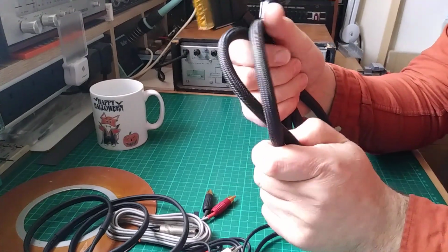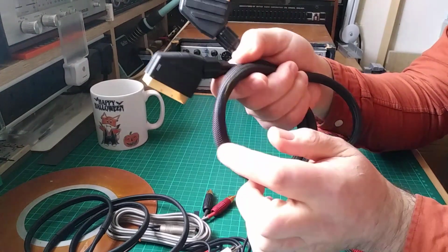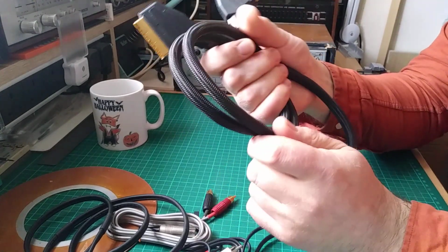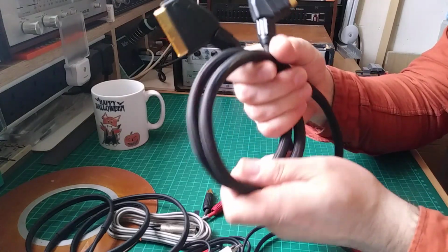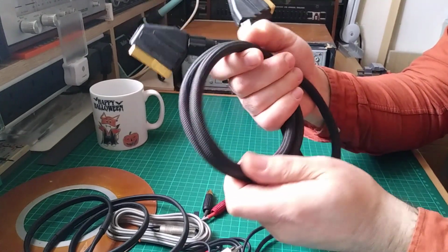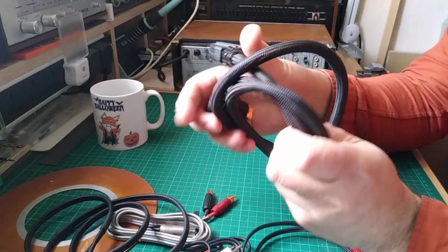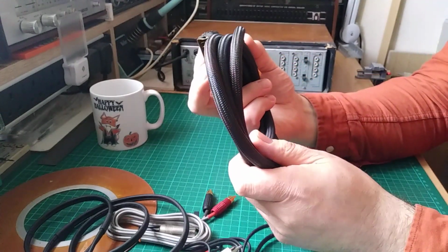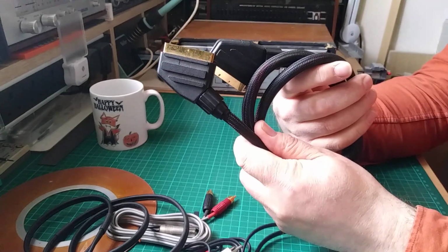a little bit tricky to work with, because I didn't have color-coded wires, other than just the outer screening, which was particular colours. I tended to use the yellow cable for composite video, and obviously I used the red and the blue and the green for the component colours, and the audio one was the tricky one, because they were all the same colour, and each one was just a white wire, so you did have to buzz it out with a continuity tester. But there we go.